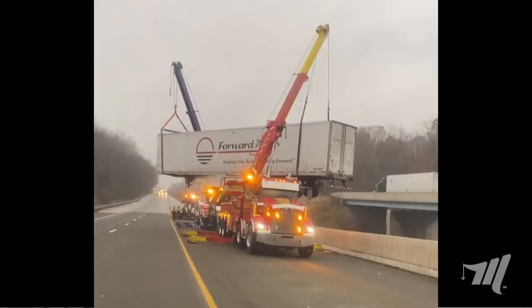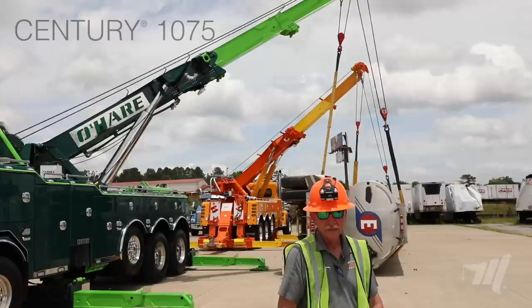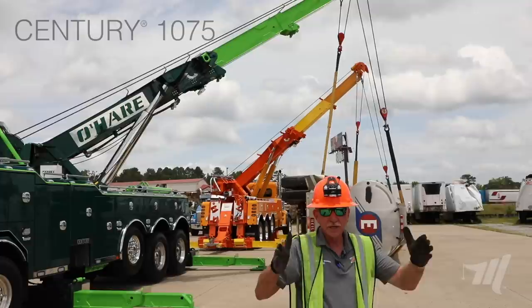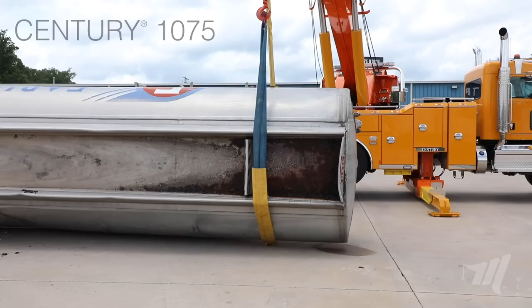You cannot have an outrigger start to lift when you're doing a lift of this height — 6 feet, 8 feet, 10 feet, 20, 30, 40 feet. This truck has to be planted. Don't take any chances. If you notice over my head, you can see both cables are almost at an identical angle. Next thing: we want to center that hook not just into the trailer, but where we think the load is going to be — try to see where that load is and try to find that center pick.